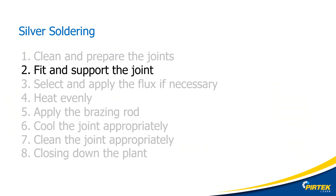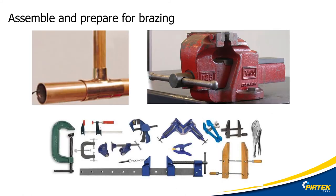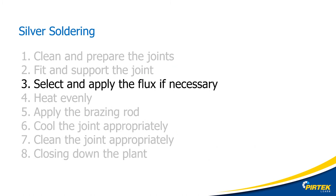Use a hacksaw to cut your tube, especially when the joints require mechanical properties, as tube cutters change the size and shape of the tube during cutting. Unless you have four arms, you're going to need to think about how you're going to hold the work for brazing, especially if sizing and angles are critical. Once you've prepared and cleaned the surface, apply flux. The flux protects the area from oxidization, promotes the flow of filler rod, and promotes capillary action.